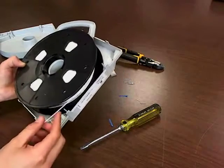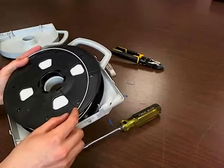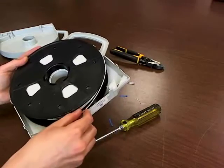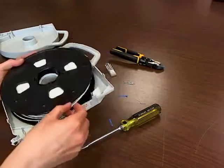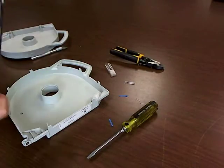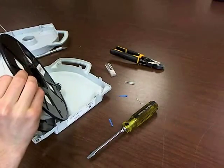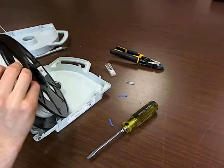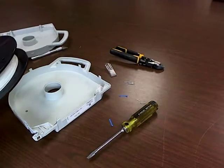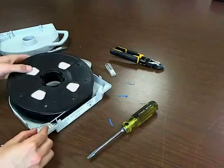The main problems you'll have had is either the filament tip has come off and got pushed back into the spool and jams up, or it just got pushed back in and you can't get at it. In any case, you just want to make sure it's wound properly, and it doesn't hurt to unspool it a little bit, because if it gets stuck underneath one of those layers, it'll feed fine for a little while and then it'll just stop feeding properly, jam up, and you need to reopen again — you get a failed print, and that's no fun. So you might as well check while you're in here.